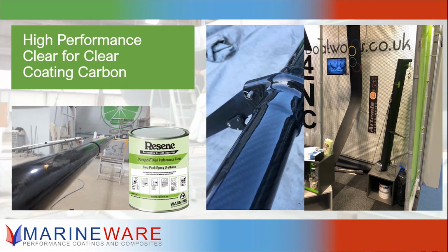Chris, you got any more tips on that side? You've done a fair few carbon bits in your days as well. Yeah, I like that. I never really used a brush. I used a roller quite a lot. I've also squeegeed it in sometimes if you're trying to get a very thin coat on, but that only really works on flatter areas. It's just trying to get that initial fill and bond that is key, without creating too much sanding down the line.